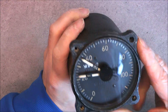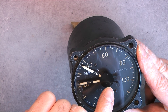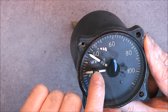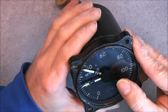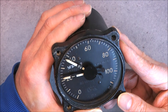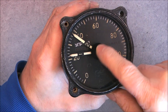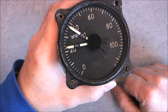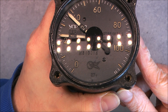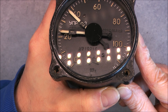This is a very typical Soviet design with all the information on the dial. There is no manufacturer plate anywhere — everything is on the dial. We have the part number, the serial number, some additional information. Serial 2, so version 2 or something like this. There is a word 'Strelka' — we will try to translate it. The middle of the glass is covered with a black dot of paint to mask the shaft of the needles. There is a very nice logo of the manufacturer with what seems to be a dial on a little paper aircraft. And '27 volts' is written with a V, not the Cyrillic B.